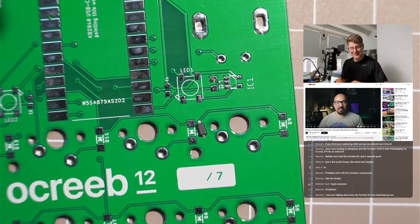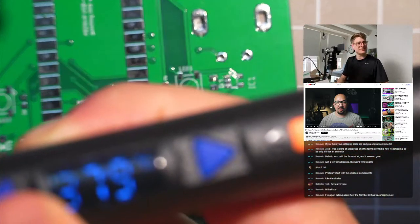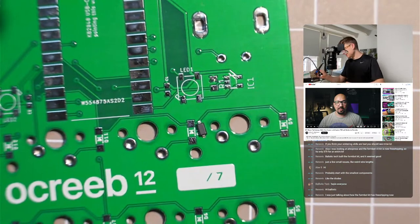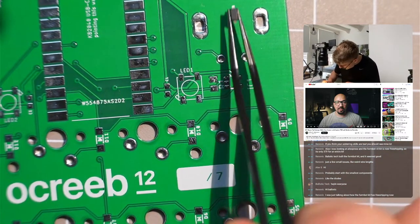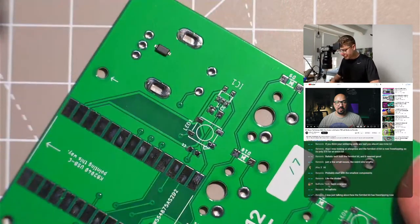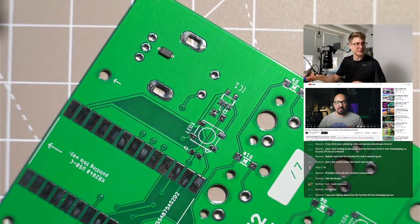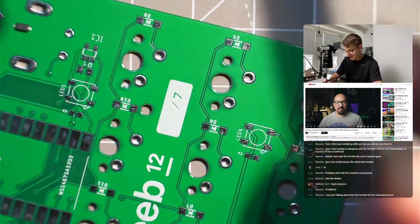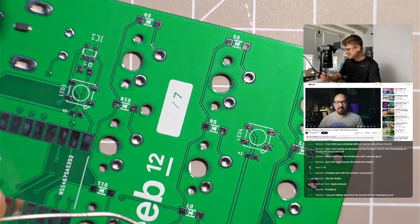You just joined in time to see me fail to solder stuff. So, it's the first time for me doing this. Let me make sure that I keep this one aligned. So, what I saw on YouTube and what I tried out yesterday, and this is a really horrible setup, just to get that straight: the solder is way too thick, the tip is way too large, this is horrific.